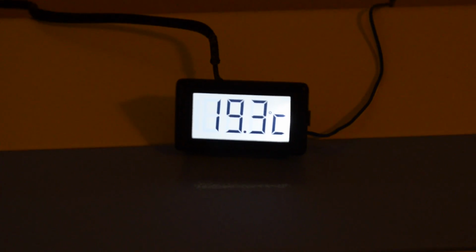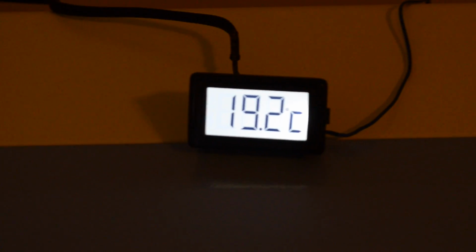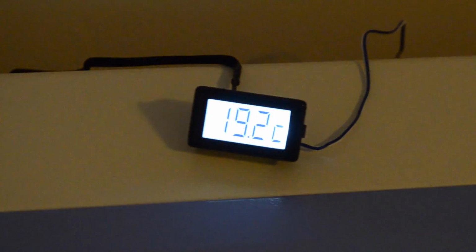I did end up putting that thermocouple on the laser tube. This is the output. This is a really cheap case modders thermocouple temperature display. It came with a really thin thermocouple, which is nice, and I just took some Kapton tape and taped it to the end of the laser tube near ground. I'm not sure if thermally that's the best, but I like the idea of not having 20,000 volts capable of arcing over into this system. That wouldn't be fun for anyone.